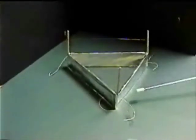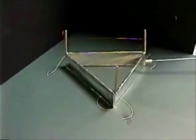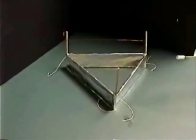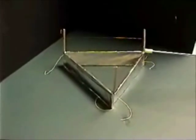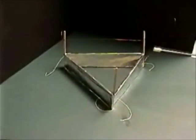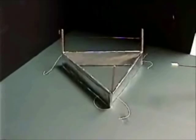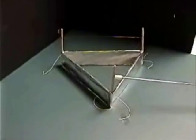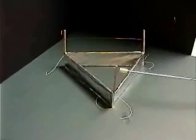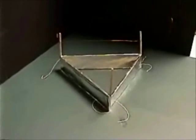So Randy, why don't you tell us about the adjustments you've made to the model? What we have done is replaced the copper wire and the tin foil to increase some efficiencies. In our earlier model, the aluminum foil we used was heavy duty, so we've replaced that with very thin aluminum foil which should cut down on weight. We've also replaced the heavy copper wire — this is the 30 gauge. I had made that mistake earlier. We also took careful detail to scrape the underside of the wire to expose the copper, so we're hoping for a better connection.